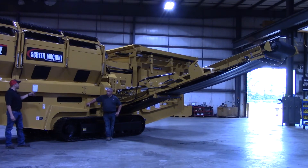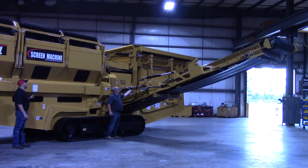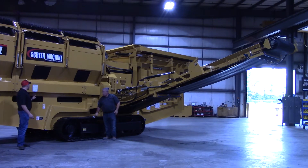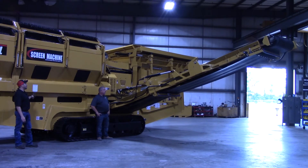For setting angle adjustment, I've got Scott over there. I'm going to lift up on it a little bit to get the tension off that pin. Go ahead and remove the pin. You're always going to have tension on it when you're going to adjust it, whether you've been running or off the truck or whatever — you're going to have to loosen that tension. We're all the way at the lowest setting here, 20 degrees. You've got 25 and 30 degree options as well.